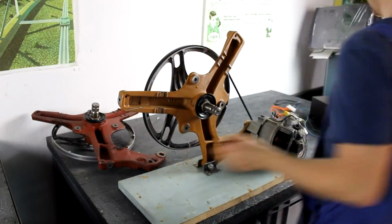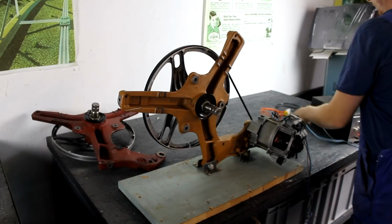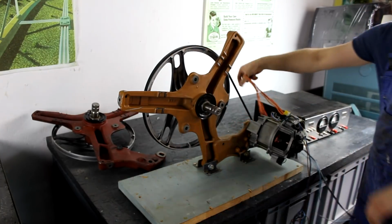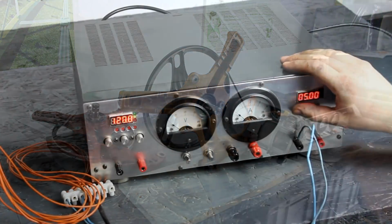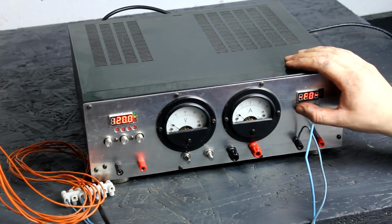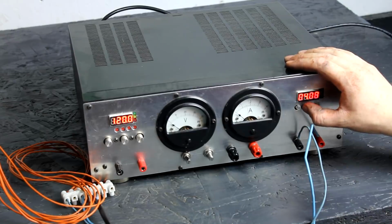Another problem that I've been talking about in one of my earlier videos was probably controlling these motors, for example having them run at constant speeds. But that only is a problem when these motors are run without a constant load and as universal motors, meaning that field winding and rotor are connected in series. What I'm doing now here is connecting my lab power supply to the 2 windings separately and using these as separately excited DC motors, and that gives me pretty much perfect control.